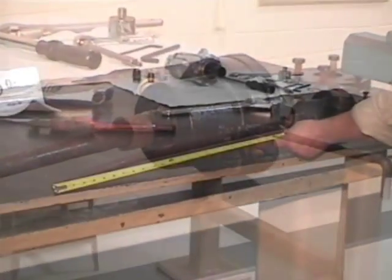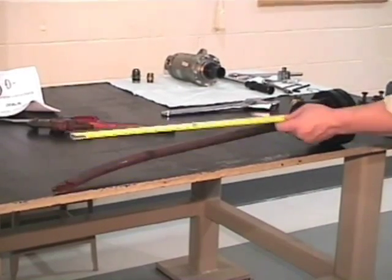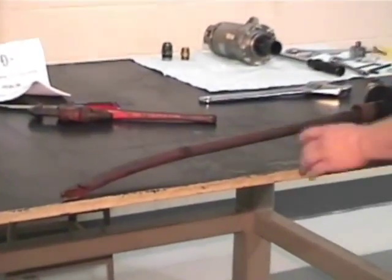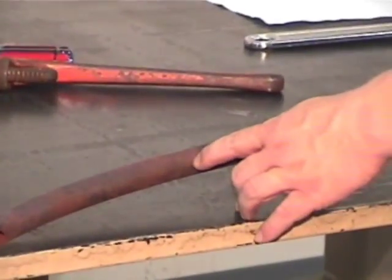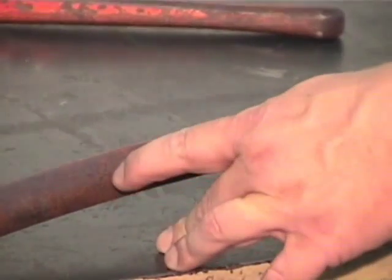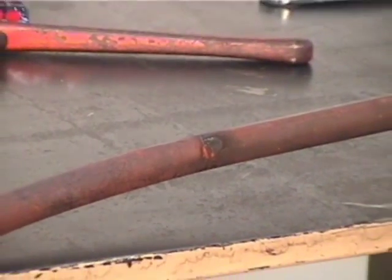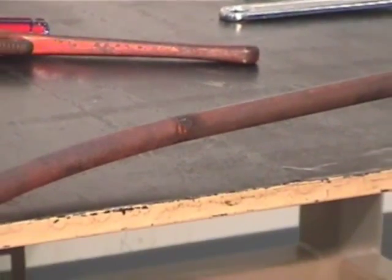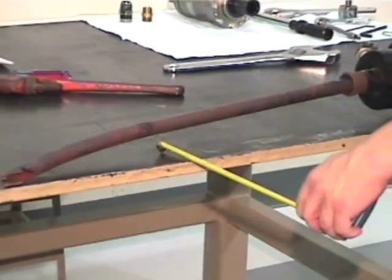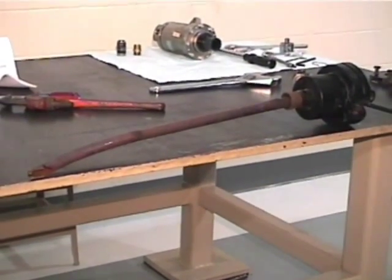The Johnson siphon is approximately 36 inches long. It is clearly visible that it was rubbing the end of the journal at about 17 inches. We are going to start our bend 2 inches further out to ensure that the siphon pipe does not contact the end of the journal. Note the bottom of the bend is less than 3 inches, meaning the bottom of the siphon was 2 inches from the bottom of the roll.